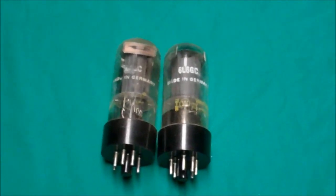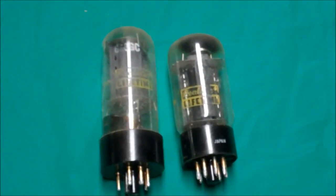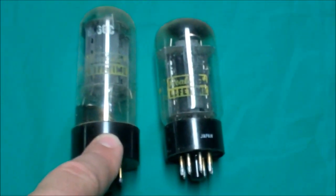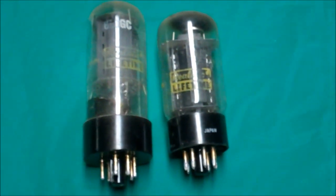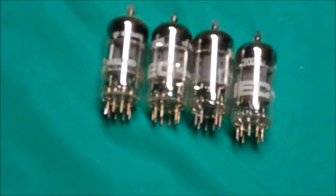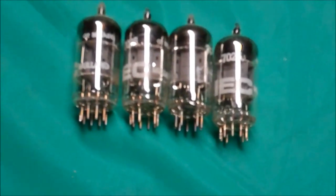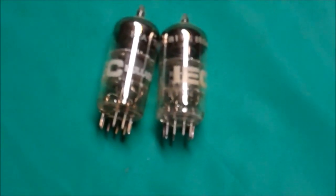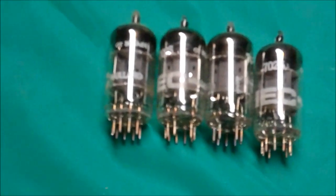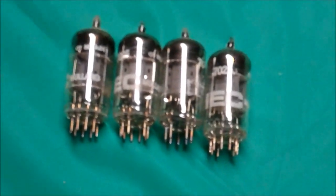Our German Westinghouse tubes — das ist kaput. One got a fail, the other got a weak. Our British Realistic tube scored a 6, which means it's kind of weak. Our Japanese Realistic tube scored a 7, which is right about half-life. But the good news is our Mullards — the 7025s, aka 12AX7s — all scored excellent, scoring 9 to 11 on gain. And our 12AT7s didn't do bad either; they were scoring 8s. These are good tubes. The question is whether they're highly valuable, because if so, I may just use them to finance repairing the amplifier.